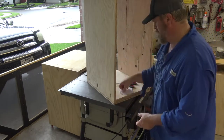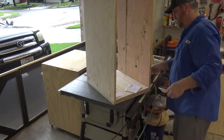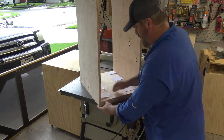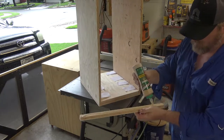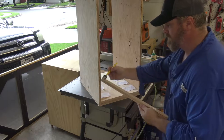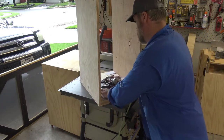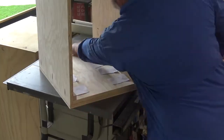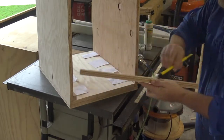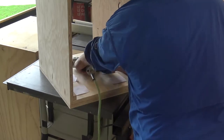Here's my little trick for my pull-out shelf. I get the shelf and turn it upside down, then I grab two pieces of paper, fold them in half, and cut them into strips. I lay them down on the underside of the pull-out shelf as a spacer. Then I'll take some scrap and glue and nail it to the side. When I pull it out, the paper will come out and it will be just a nice tight fit — and over time with the wood, it will get a little slop and be nice and smooth.